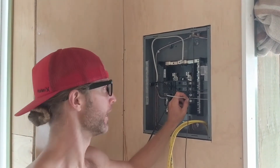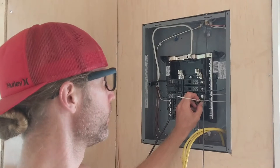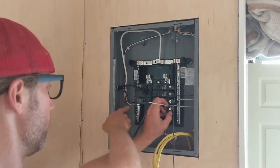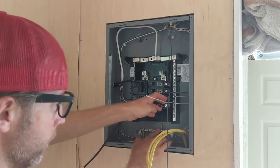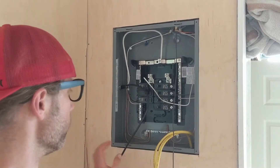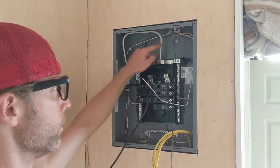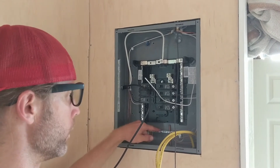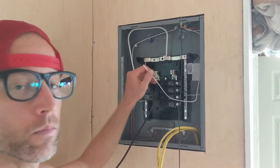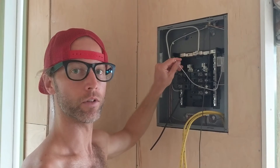Doing some electrical wiring here in the main panel. So far I've got about two circuit branches done — a bed and a bath. This goes to this breaker, then through the neutral bus bar and the ground bar. This giant wire goes to what you may remember as our grounding electrode. This is coming in from our soon-to-be inverter in the solar shed, along with the neutral from that, which is grounded to the ground bus bar. I just have kitchen one and an outdoor circuit to do after I finish up the lights and smoke detector, and our main panel will be about ready to rock. Then off to the solar shed to finish that up.